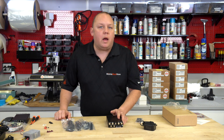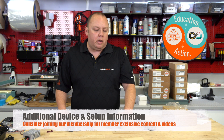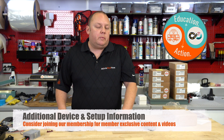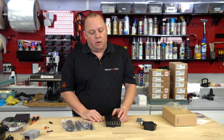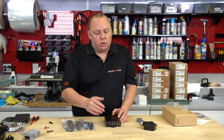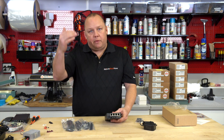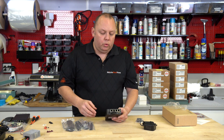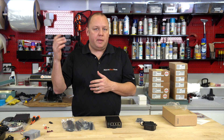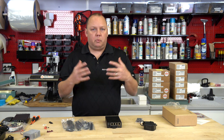The Transit Pro E is what Eric is currently running inside his RV at the time of filming. They had the Transit Duo as their mainstay for quite a few years, and the reason for switching to the Pro E was the additional Ethernet ports and PoE capability. Since it's mounted in the front of the RV, he could uplink to the Vega Touch system controlling the TV, using an existing Ethernet cable behind the TV, and then use a second port for an access point inside the coach.